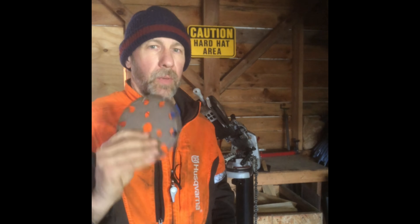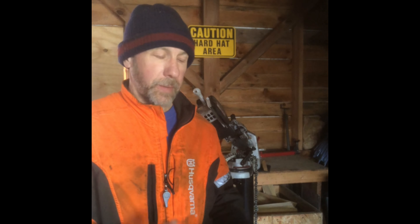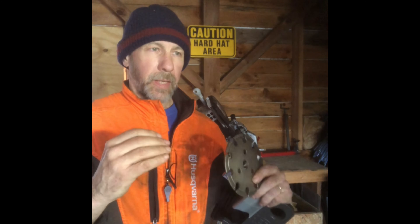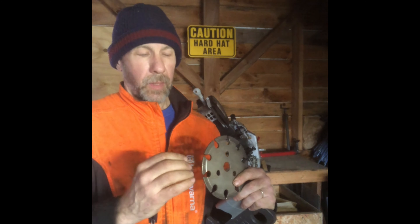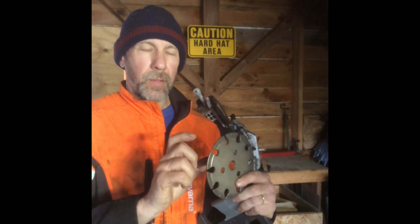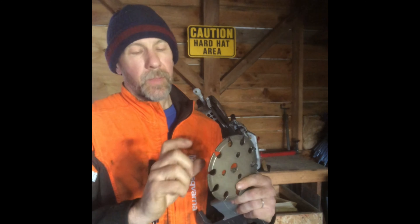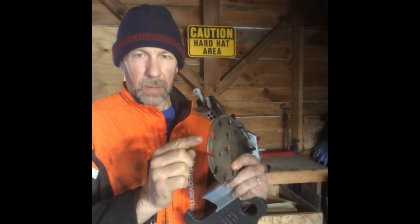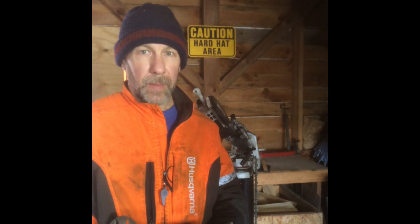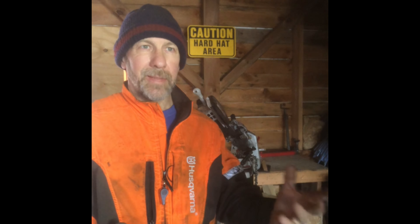The other consideration is the actual grinding tool — the stone. A lot of grinders come with an actual stone, but I don't use them. Those need to be dressed on a regular basis. As the stone is sharpening the tooth, the hardness of the metal is abrasive against the stone; the stone loses its shape, and you need to take a block of rock and reshape the edge of the cutting stone to maintain the proper shape of your tooth. It's doable, but you go through a lot of stones — it's a maintenance issue I just don't care for.